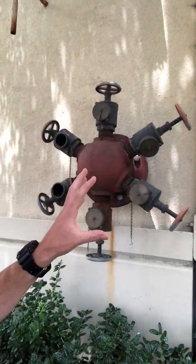There's several ways. You could do flying standpipes and elevated, pulled hose on the outside of the building. Those work. You may be able to pump right into the first floor outlet, but if there are pressure reducing valves or something like that, that may get in your way. Another option that you have is to pump through the fire department test header. This is normally a discharge scenario.